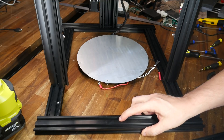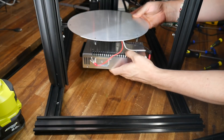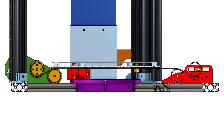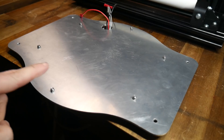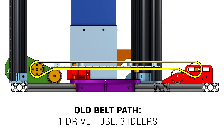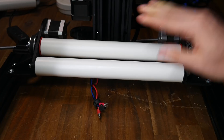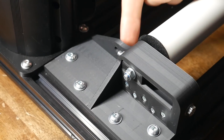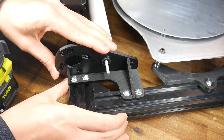You should understand that I completed this project designing it piece by piece as I went, experimenting with packaging options, and trying to use parts that I already had on hand. Because of my design-as-I-went approach, I had a problem that required a design change halfway through. The original belt path used three idlers to create space for the power supply under the machine, but the mounting lugs on the existing FL Sun bed intersected with the top of the belt path underneath and required a change. The new design only had one idler roller, giving a simpler belt path, but did require the power supply to be mounted on the side. Because of this, you might notice in the footage the additional rollers are sometimes in view, and the parts still contain the mounting holes for the old rollers. I've also updated some parts since filming, so expect some changes there.